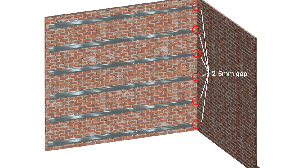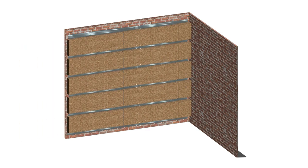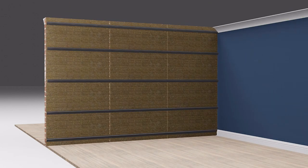An important note: the channels should not make contact with the adjacent walls as this will short-circuit the system and encourage sound vibrations into the new partition. The aim of this system is to isolate it from the original structure as much as possible, so watch out for these small details and use packers to help you. The mineral wool can touch the original walls as it's vibration-dampening and won't transmit vibrational energy. This system is designed to have a 25mm space between it and the wall, which also allows acoustic mineral wool to be slotted behind the channels on a brick wall.